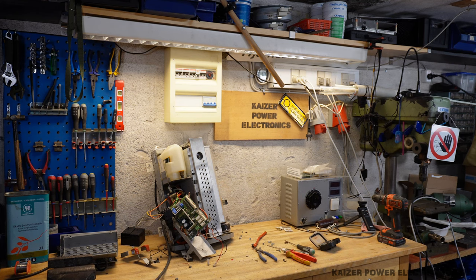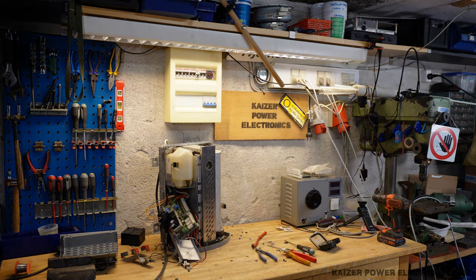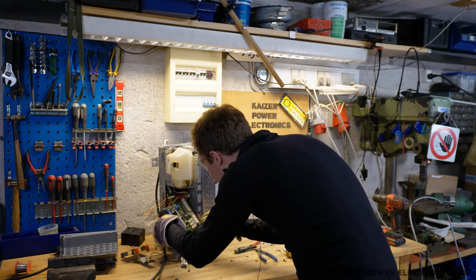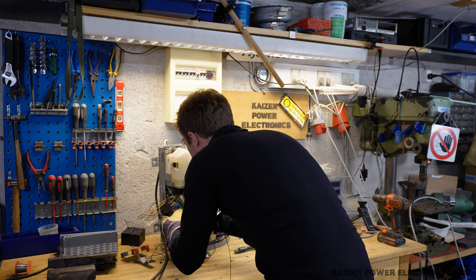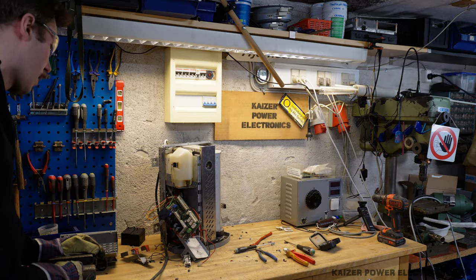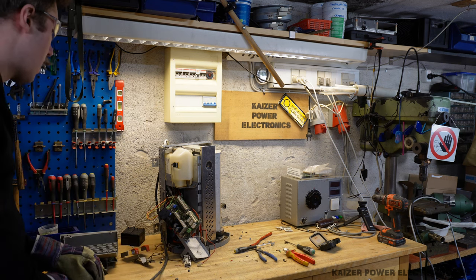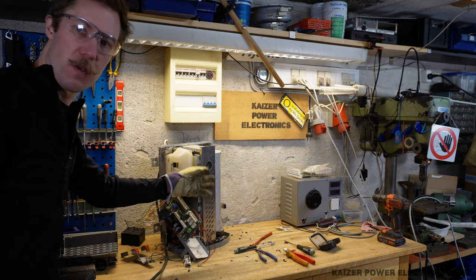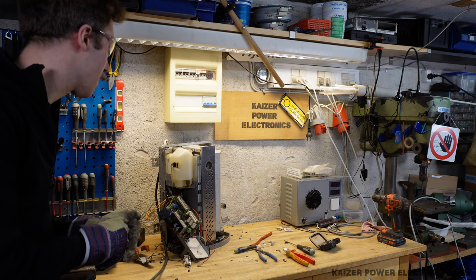Plugging the unit back in — we've got the fan spinning. Now it's angry. The fluid sensor got disconnected from all the handling of the PCB. Reconnecting it — just like that — and we're back in business. AC power on; it lights up on battery too, despite the battery being disconnected — nobody knows why. Heating should hopefully turn on. And heating turned on. There is starting to come smoke out of it here. When I ran the pump last time, I guess a bit of oil got into the heater and now it's slowly burning off.